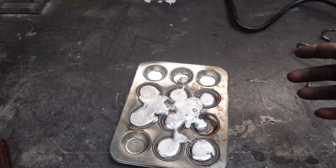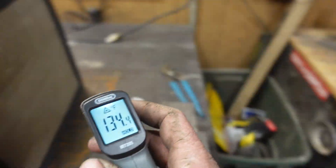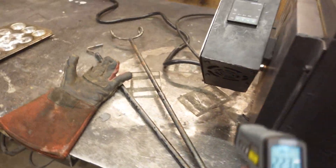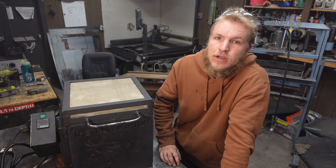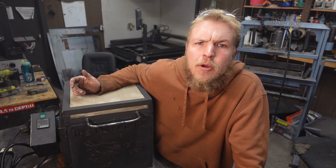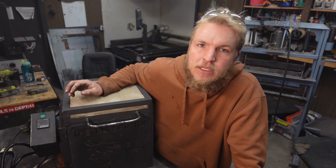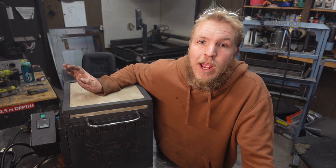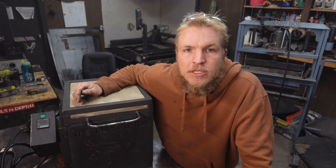So what are the final results here? 130 Fahrenheit on the outside — not bad. 223 Fahrenheit on the electrical box — a little toasty but not that bad. We did it, it works great. From where it was sitting with the pre-burn at about 230°C, it got up to 700°C within 30 minutes, which is great. We'll see in the future how long it takes from nothing, but I'm very pleased with the results.